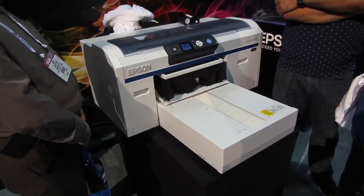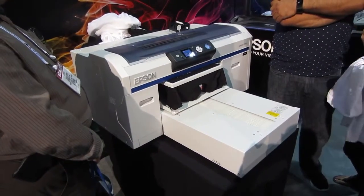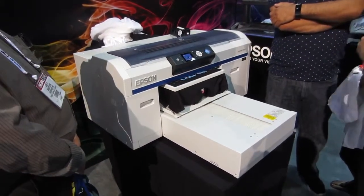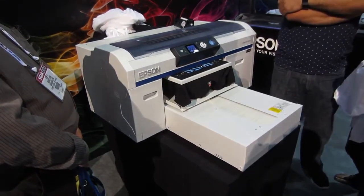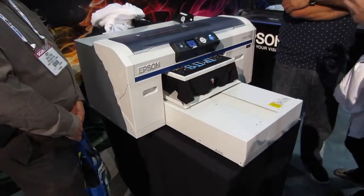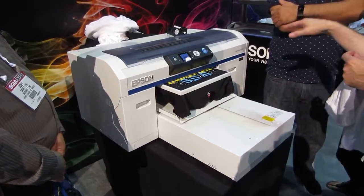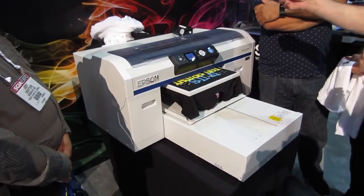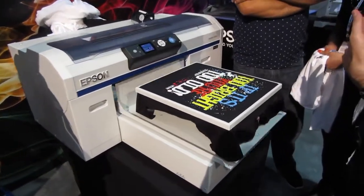It has 600 milliliter ink tanks on board inside those doors — more than any other machine. The ink usage per square foot is about the same as anybody else's printer, pretty efficient. Our software will tell you exactly how much ink is used on every single job, because we know through the nozzle camera how much ink is fired. You can type in the software how much you paid for the ink cartridge, so you get the right cost calculation.